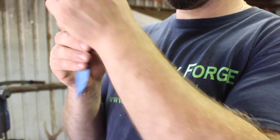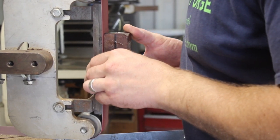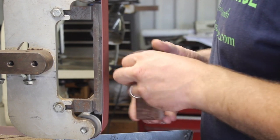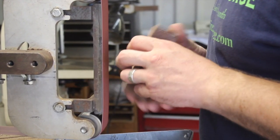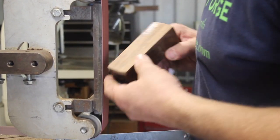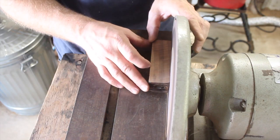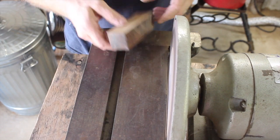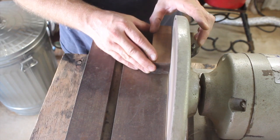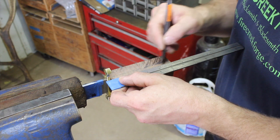The second time around I didn't use any Teflon tape; that didn't seem really useful or necessary — just petroleum jelly right on the tang and guard areas. Now I need to square up the handle wood block in relation to how it sits on the knife. You can see lines drawn on the end of the block where the guard sits, so I want to square those sides up and then square the opposite sides to those, giving us four square sides consistent with how it sits on the knife.